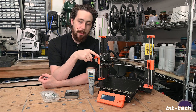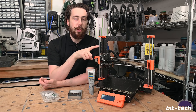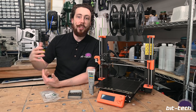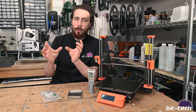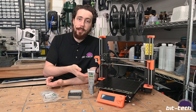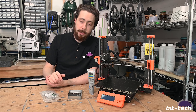One change I've made is swapping out the nozzles. The default on the Prusa is a 0.4mm nozzle — pretty standard across all i3-style printers — and I swapped this out to a 0.2mm nozzle. I'd like to use that for things like cable combs, because the gap between holes in cable combs is pretty small and a 0.4mm nozzle basically doesn't fit unless you make it really wide and the comb looks ugly. Going down to 0.2mm lets me get more wall thickness between the holes without the risk of everything falling apart.